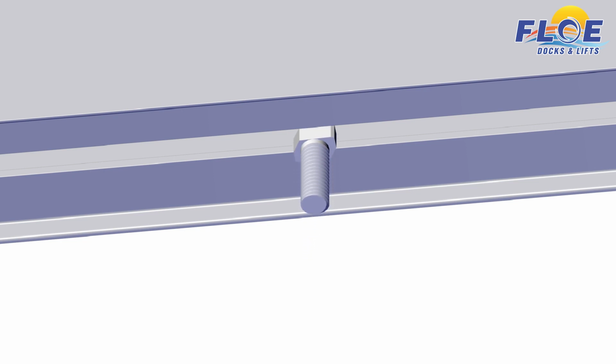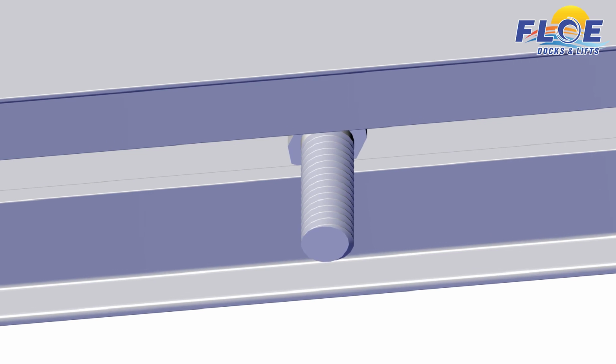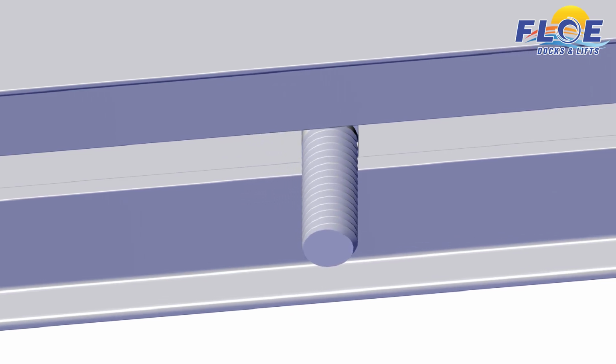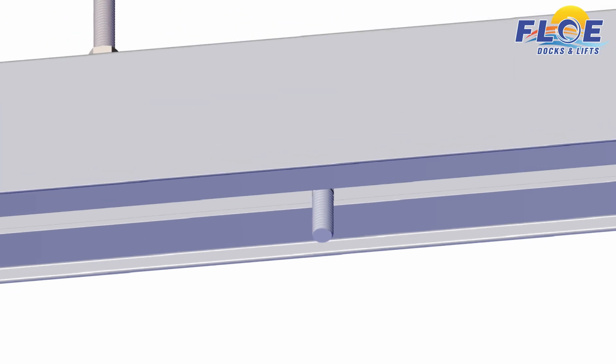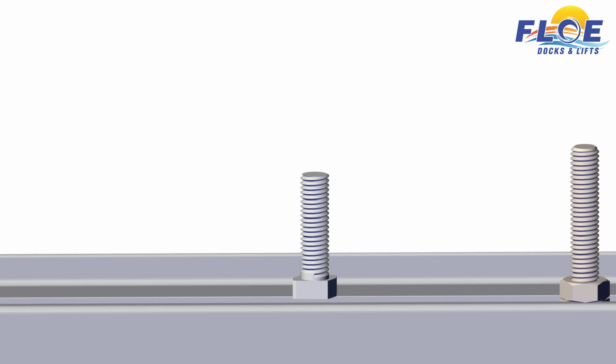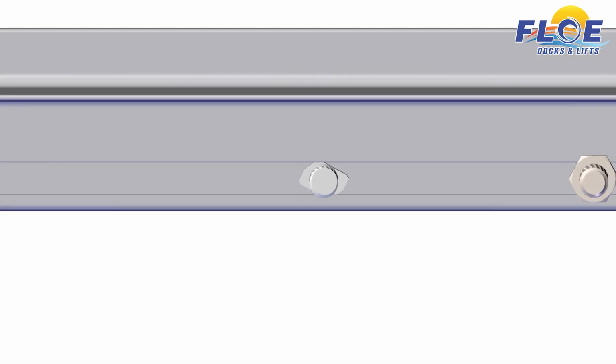Next, twist the bolt a full 90 degrees so the bolt head is perpendicular to the channel. The head of the bolt must be completely perpendicular in order to lock. If this is not done, damage and/or injury may result from an improperly secured canopy. Ensure that the special bolts are properly locked before adding and tightening nuts. Here's the same process on the top channel of the canopy rail, which you'll be doing later in the Maxis assembly.